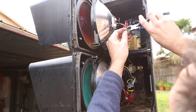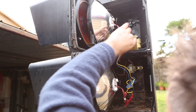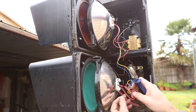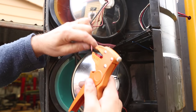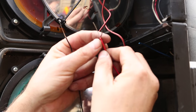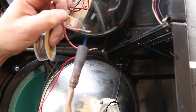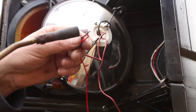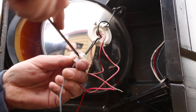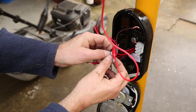I was pretty lucky — both the traffic light and the pedestrian light were fairly functional units, and they'd already been retro-fitted with what looks like MR16-style prong connectors to allow LED lights to be connected up. Here I'm just re-terminating new wires to elongate them and thread them back through the traffic light down to a common spot, which then connects to the wires that go down the pole. I soldered them using my plumber's gas bottle, then did continuity testing and labelled the wires so I know what connects to where.